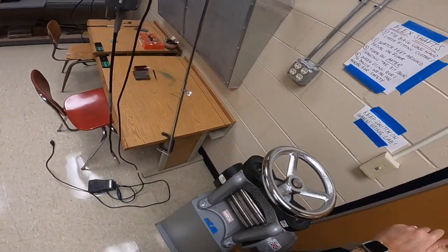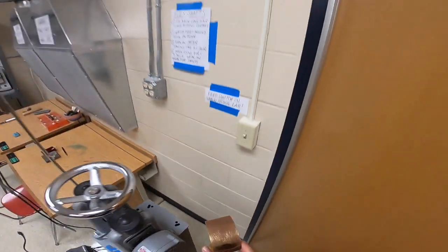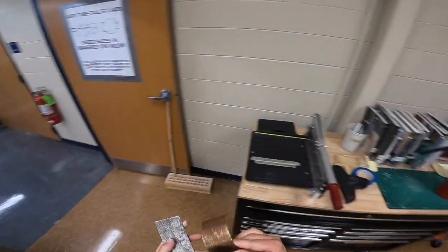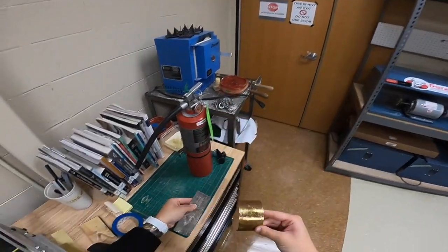I have a little bit of an imprint, but I'm not satisfied with my print. So I'm going to put it back on and go from the opposite direction — I don't recommend doing this all the time because sometimes it can slip and you get a weird imprint. I'll tighten it. It should never be stuck; if it's stuck, that means it's too tight. You want to make sure it's moving and you can see your metal and the plate go through. It will be tight and sometimes you have to use two hands — as long as it's moving, you should be good. I'm more satisfied with the embossing and imprint the second time around; I can see more of that texture.